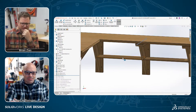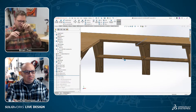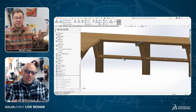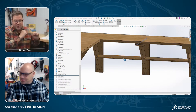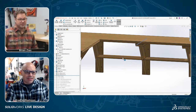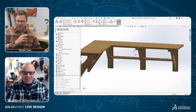Yeah, dude, some things you do in CAD you don't do at the part level, you do it at the assembly level. And I'm really glad I did that. So I ended up mounting everything to the wall, setting it all up, and then coming back, even though it was a real pain. And I routed out these shelf holes after they were all mounted with a laser level. And they were definitely not the same position as they were as a raw part, if that makes sense.